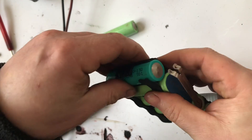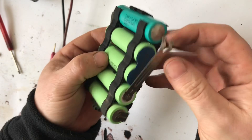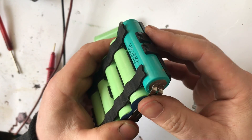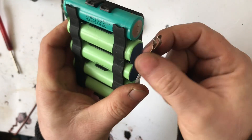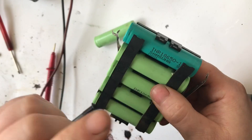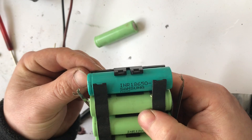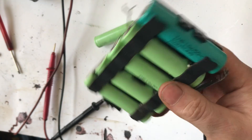That's probably the hardest job done. Now we're going to start the soldering iron because I have no way to spot weld them. We're going to tin the little contact arms and then very quickly try to solder them together, being careful not to put too much heat into the battery — because if you put too much heat into a battery it's done, it's dead, there's nothing you can do about it.